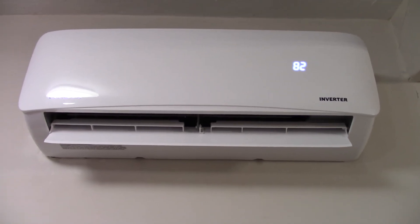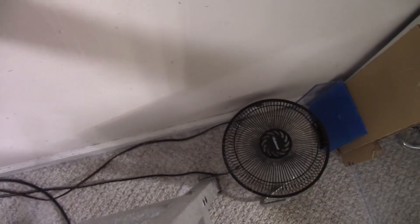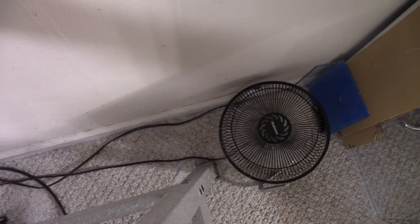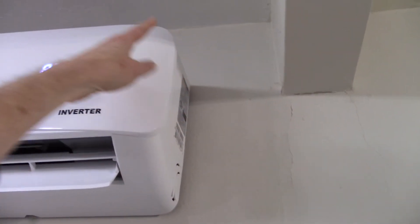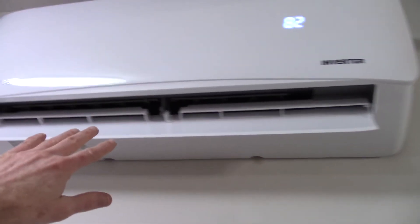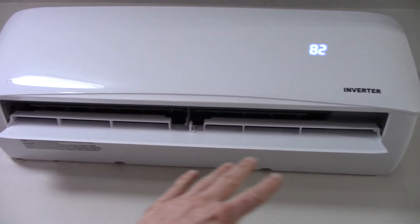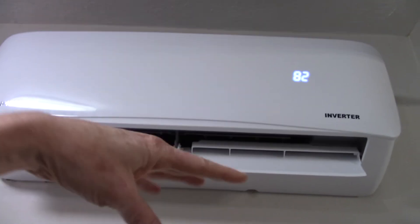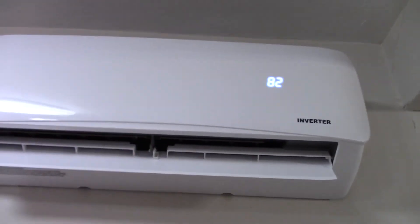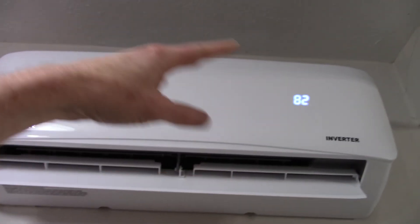I don't have a ceiling fan, so in my case I just took this little fan here — that's what's making all the noise. The mini-split itself is pretty quiet, and the fan is blowing cold air up over into the intake, which makes it run harder. It's blowing out nice warm air now. If I turn that fan off, in about a minute it'll slow down because it's not putting the cold air up. When I turn that fan on again, in about a minute it'll start blowing harder because cold air is going in there.